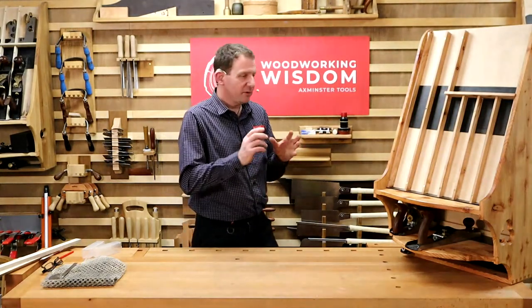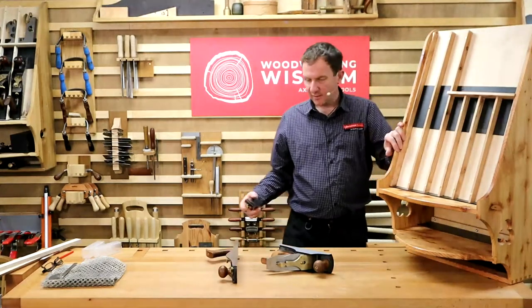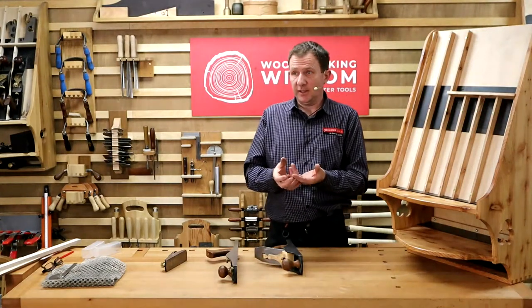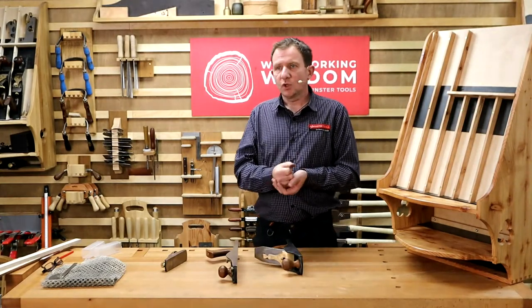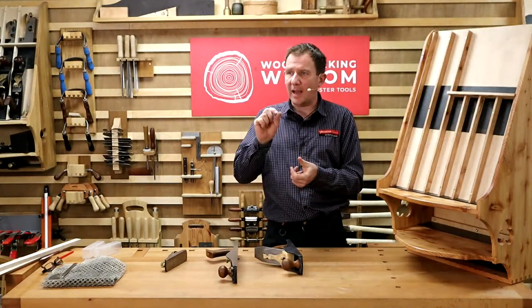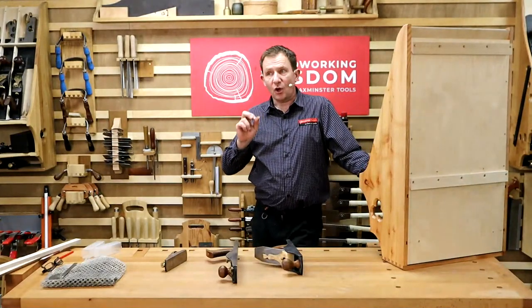We're on hand plane boxes — something that hangs on the wall. I know when we first did these I was absolutely petrified about how heavy they were going to be. Whatever you put on the wall, make sure you fix it nicely. With these, we actually glued and nailed on the plywood batons — you could screw it if you need to. If you've got batons on your shed wall already, fix onto those. If you've got a wooden shed with four-by-two bearers, use those as your hanging points and screw into those. Definitely have two French cleats when hanging something with a lot of weight.